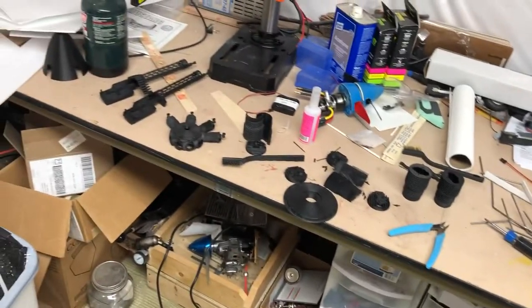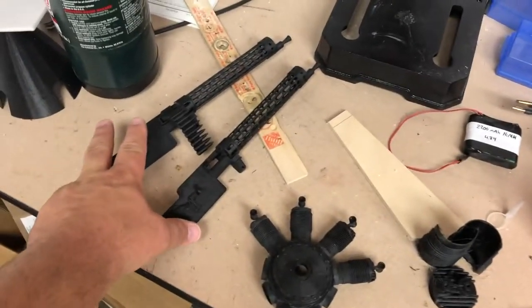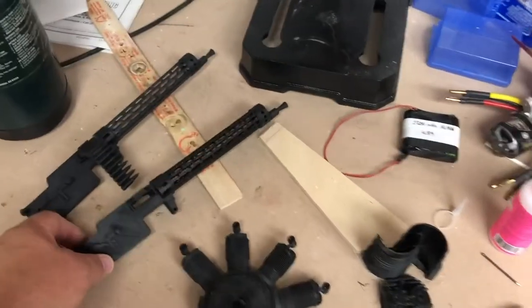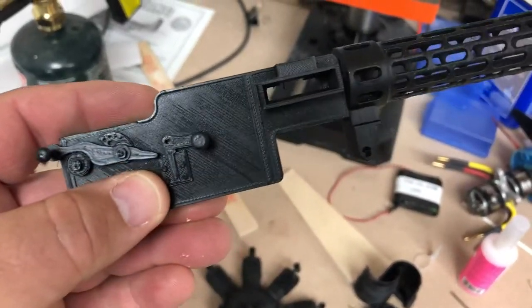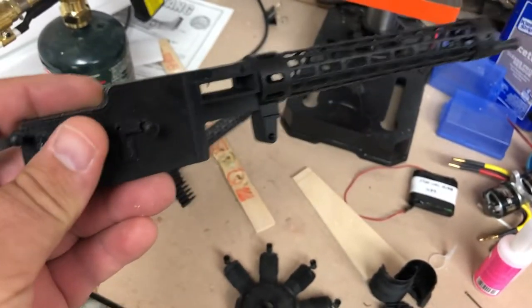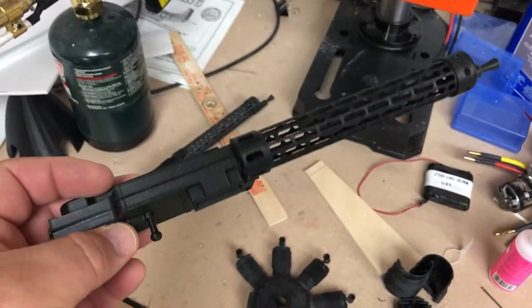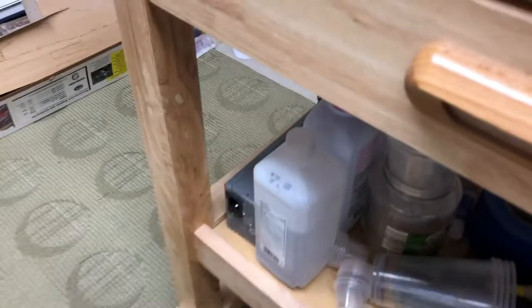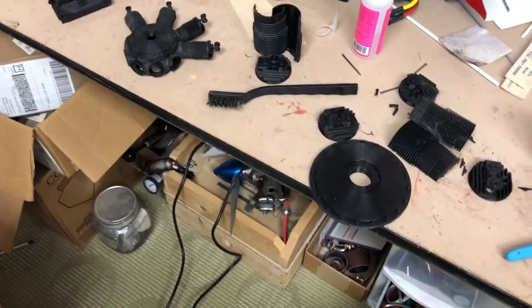I've also been trying to work on 3D printed parts. Over here on the table we've got our 3D printed Spandau guns - these are printed in PETG, and getting close to them you can still see quite a bit of the striations. Even putting some matte black or matte clear on them didn't really seem to help things blend together. So I went and I'm trying this Poly Smooth PLA - it's like PLA but not PLA, you can smooth it with rubbing alcohol. It does work; I need to perfect my technique, but at first I had printed the wrong size - way too small.